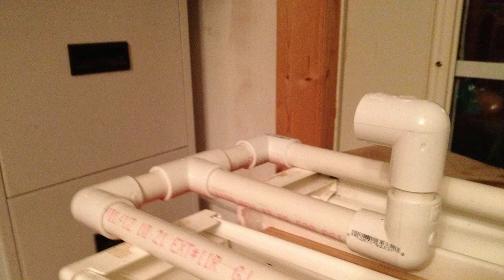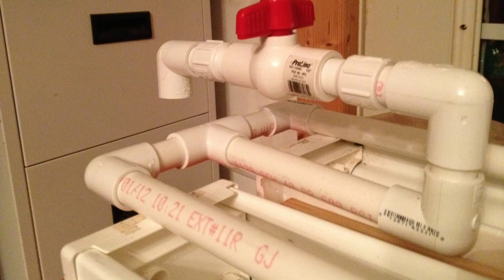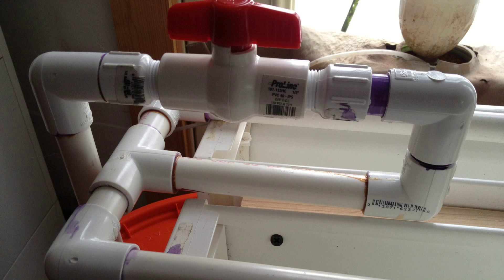Cutting this next piece is a little trickier because you have to make sure that the tube on the bottom is just about as wide as the valve on the top, because the fill tube comes up and you want to be inside that bucket lid. Here you can see the fill tube coming up from the bucket feeding into the manifold that we just built. Everything was dry fitted at this point, then we took everything apart and used primer and PVC cement on all the connectors. The valve is a threaded valve that gives us the ability to take it apart at a later date.